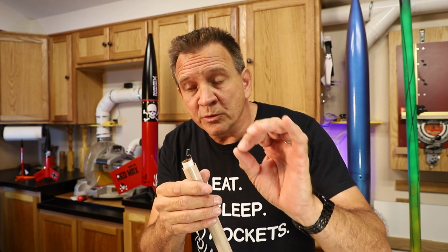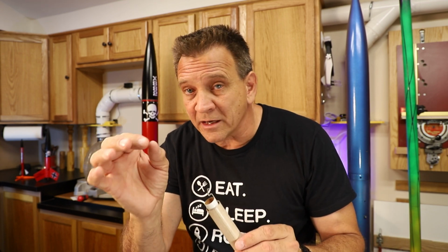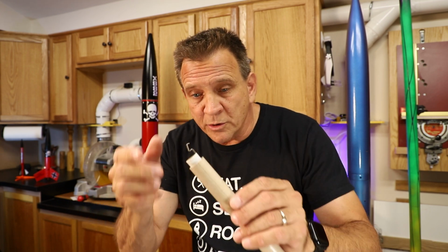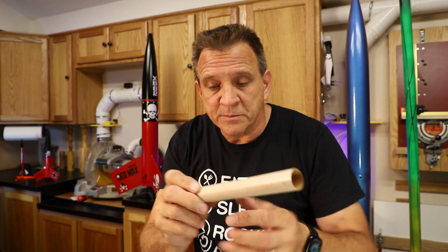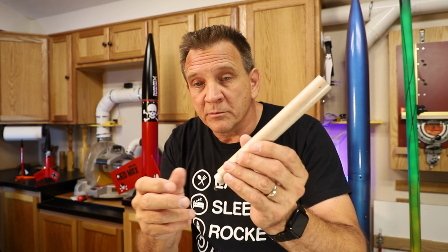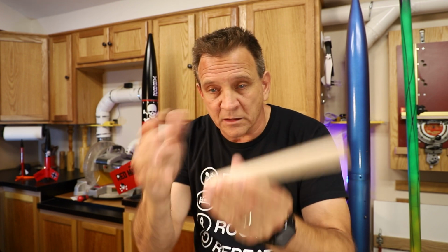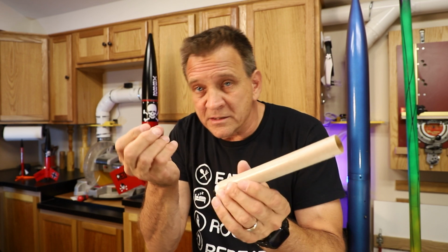Use enough glue. Remember, if you use a little bit of glue, it gets tacky fast. If you use a lot of glue, it becomes a lubricant, and you can move it and turn it and rotate it around. Most people don't think of glue as a lubricant, but it does. So it gets rather slippery and it can move around, so it gives you a little time. Then the glue dries and it begins to set. And that's what we're going to wait for now.